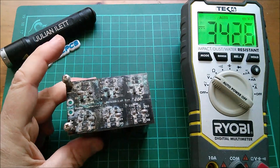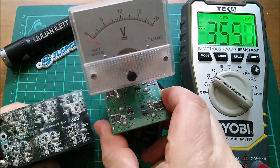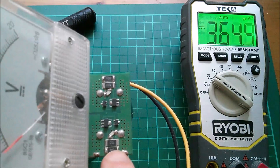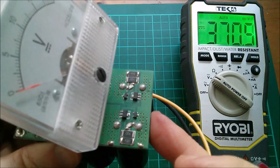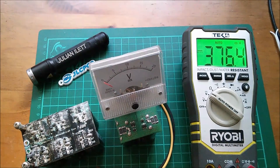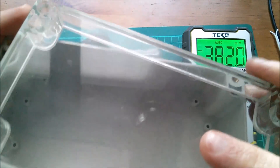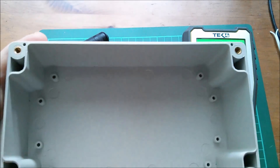So what's the solution? I think: chuck this one out and wheel in another one. I have this one which is very similar - it's got a different board, this one's green versus the black PCB of the old one. I also modified this one a while back with some LEDs wired directly across the resistors so that when the cap gets up to the forward voltage of these blue LEDs they come on. That's going to go in place of the old one. I don't want to destroy another capacitor bank, so I'm going to use this box which has a translucent front so I'll be able to see the LEDs.